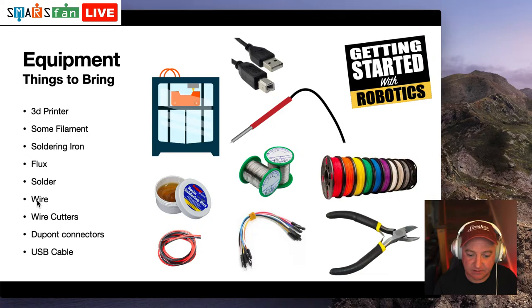It's not thermostatically controlled. It's just plugged straight into the mains, heats up after about 5 minutes, and away you go. Another thing with the solder, you'll need flux. This is one of the mistakes I made in the early days. I didn't buy any flux, and it's a very gooey substance that helps the solder form around the parts. So it helps them run in all the little cracks and crevices and just form a really solid, tight mechanical bond when it sets. So this is a must. You should get some flux.